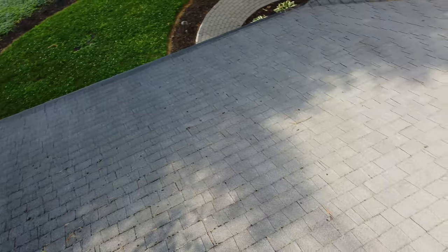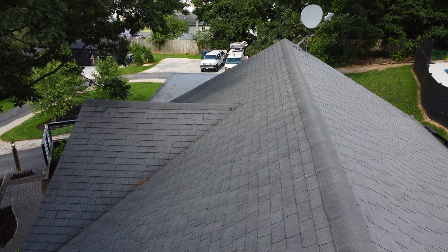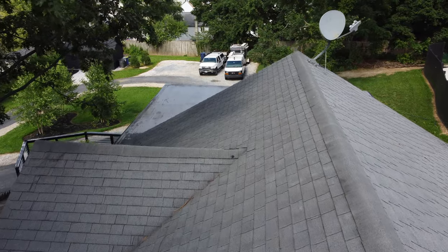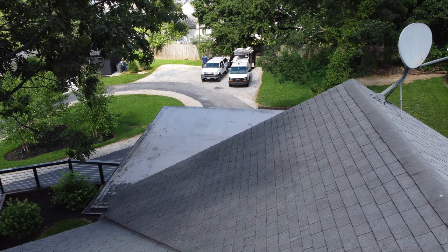The flat roll roof is in good shape. The problem is the granules — the granules embedded into the weather surfaces, the top exposed surfaces of the shingles. They're made of fine-grained, opaque, crushed particles. The granules reflect sunlight, which helps keep the roof cool, add weight which helps the strip bond well and improves wind resistance.